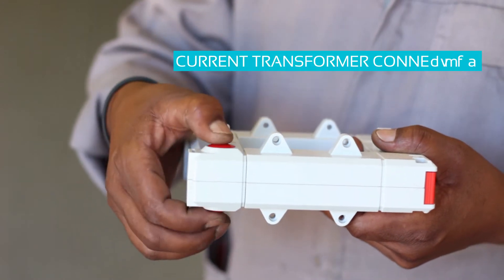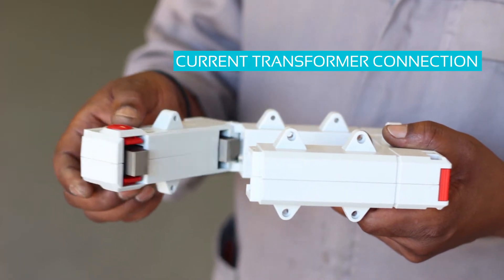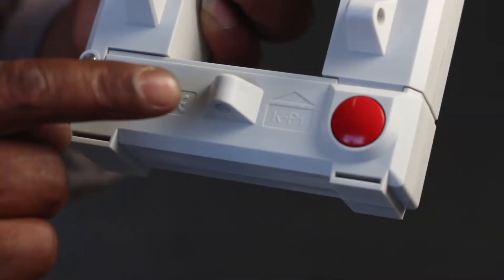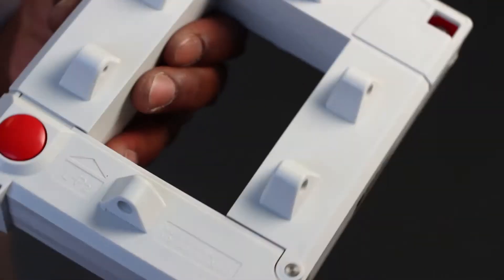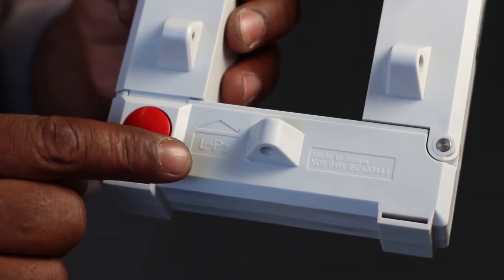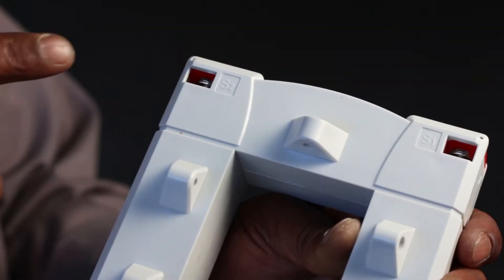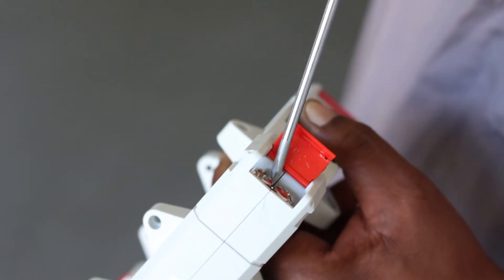The current transformer has to be provided locally — it is not provided with the Power Factor system. Current transformers are normally marked with P1, P2, S1, and S2, and should face the supply transformer with P2 on the load side.